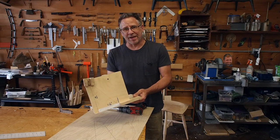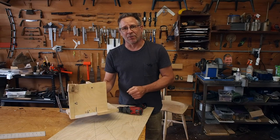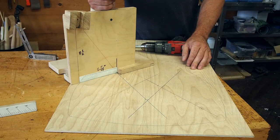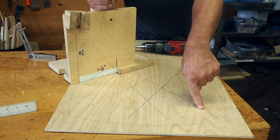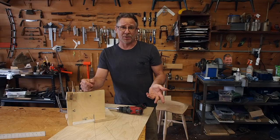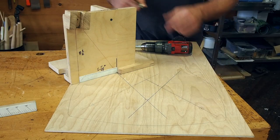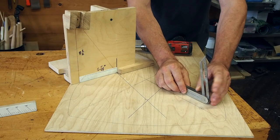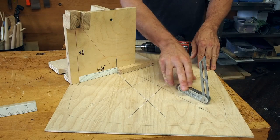Here's the fixture I made — it's pretty simple, and I'll tell you more about it in a minute. First let me show you how it works. I start, like most chairmakers, with what we call sight lines — lines that tell me what direction my drill bit should be leaning at a specific angle to get the angle I want for each part. Normally you'd have a number associated with each hole, set a bevel square to it, and use various techniques to match that angle. That's basically what this fixture does.